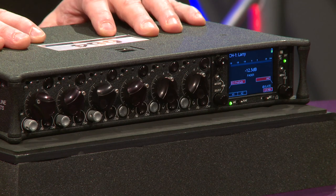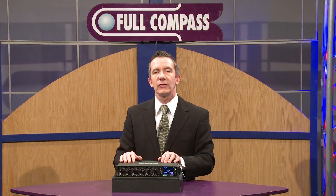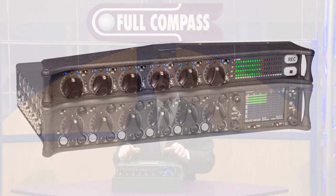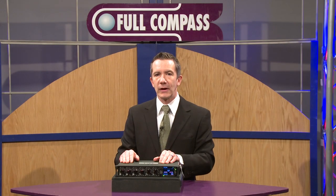There's an additional accessory that we sell separately called a CL6 that will expand the 664's input capability to up to six mic inputs and six line inputs. Just by attaching it via a small multi-pin connector, it will allow up to a total of 16 tracks — so you'd have 12 ISOs and four bus tracks recorded to the device.